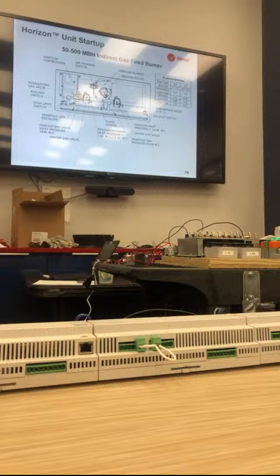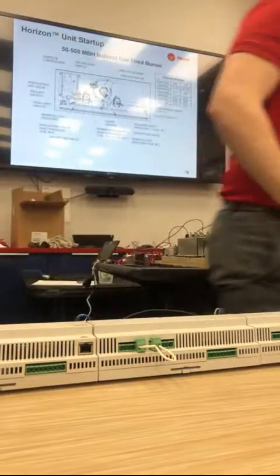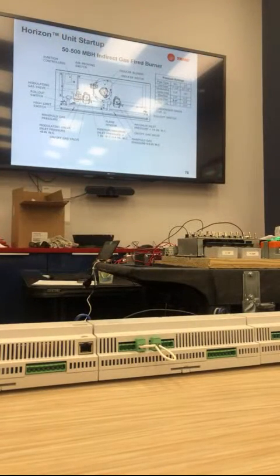So what's going to happen with the min rise when my modulating burner goes to 100% or is at full capacity, and I switch on my on-off? This goes back to min, but I have a min 10 rise. So I'm automatically going to jump up 10 degrees when I'm switching between heat 1 and heat 2 coming on. So that's where that 2 to 3 degree rise becomes an issue. It's very hard to control because of the way the burner is set up.